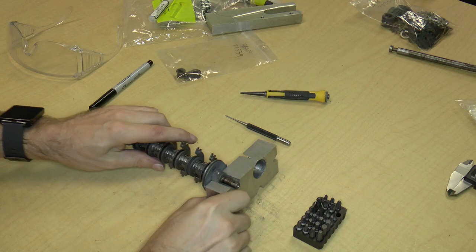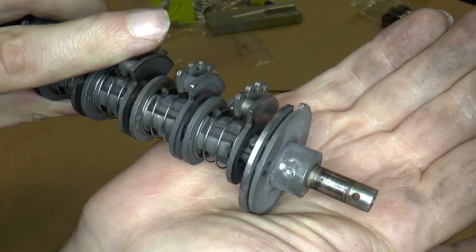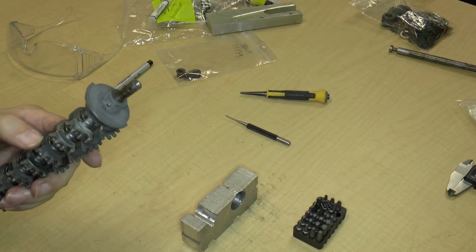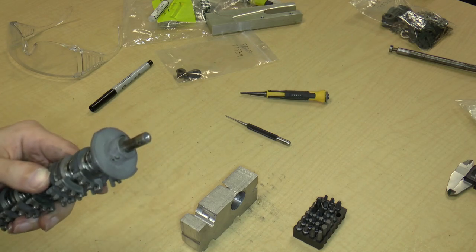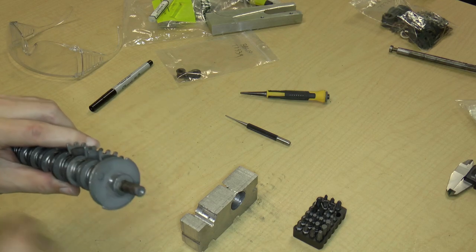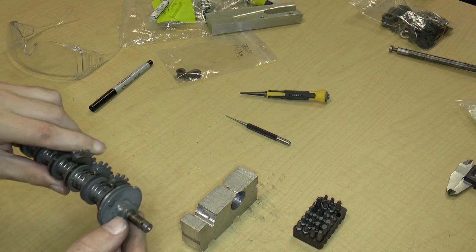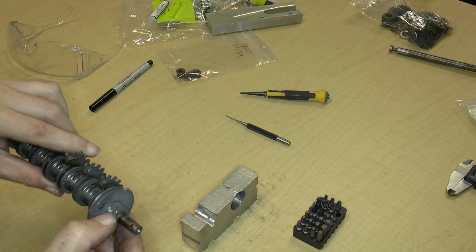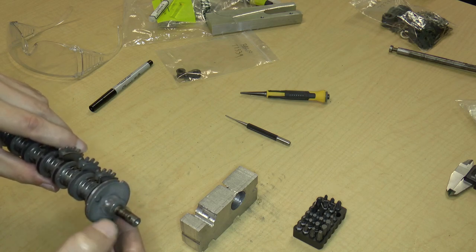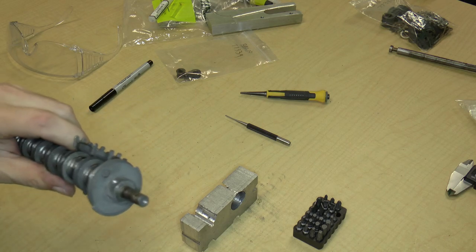Okay, so this is Rob again. Let's take a look at this taper pin. It's been, by now, extremely abused. So this is the problem with taper pins, is that when they're in, they're in. Unless you're lucky, I think, there's very little chance of getting them out. In this particular case, banging on it just did not work. Heating it up did not work. I even took a small end mill and milled into the pin, at which point the mill broke in the hole. So at that point, you may as well just give up. There's absolutely no way of getting this taper pin out.